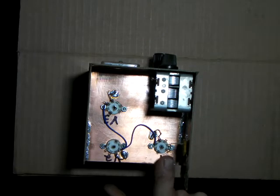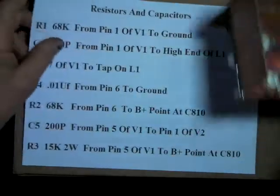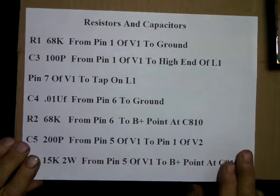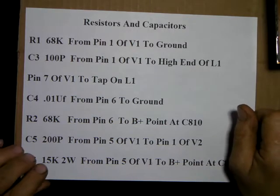Okay, now turn this around where I can see the back end of it. Next on the list is going to be the resistors and capacitors for V1. We're just going to hook up the oscillator for right now, and in the next video I'll go to V2. So here's what we got for right now. First thing we're going to do, okay, you can see R1 up there. That is a 68K half watt resistor. I didn't mark it half watt, but wherever these need power, like a little heavier resistor, I'll denote it and let you know. But for the most part, they're all going to be half watt resistors.